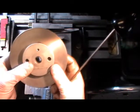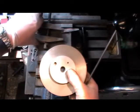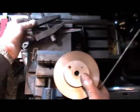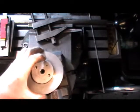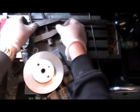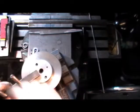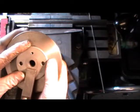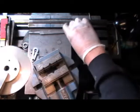I line the crank pin up so it's half and half on the cast iron wheel and the crank pin, and then I'm going to clamp it with my tool clamp. Put it in my drill and drill the hole to the depth. So I'm just going to put my tool clamp on here, just lightly grip it, make sure I'm lined up where I need to be — that's about there — then I'll just tighten my tool clamp up.